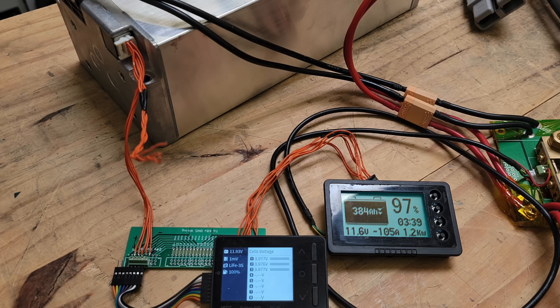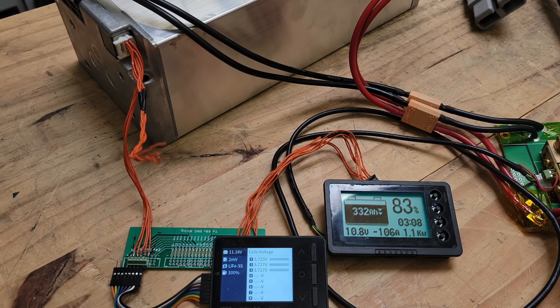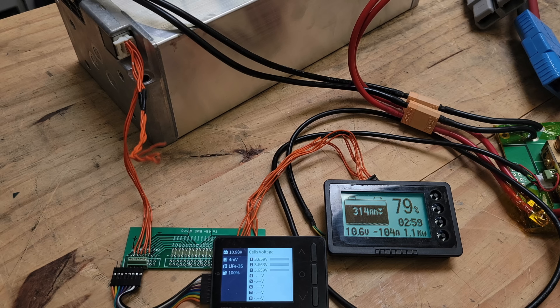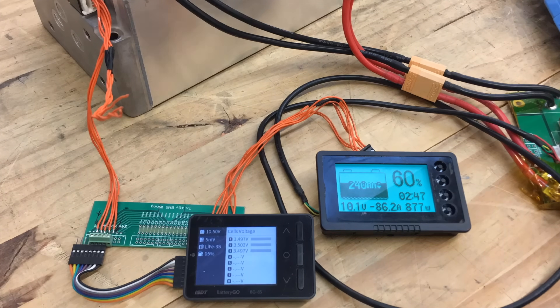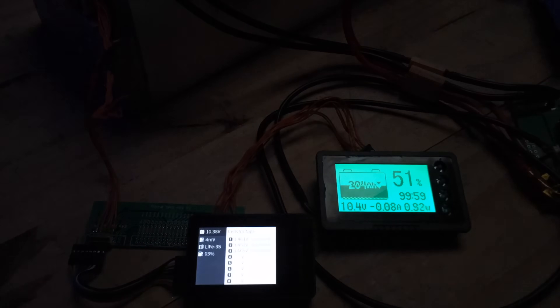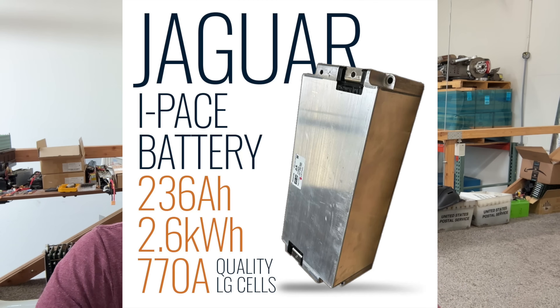This test took over two hours. The phone ran out of battery so I couldn't export video — what you're watching are still images taken every 10 minutes. We started at 400 Ah; we're at 297 now. Somewhere in here the load timer quit, so I restarted it. Using a different camera for the final number: 204 out of 400, so about 200 Ah was extracted using just a regular 12V inverter.